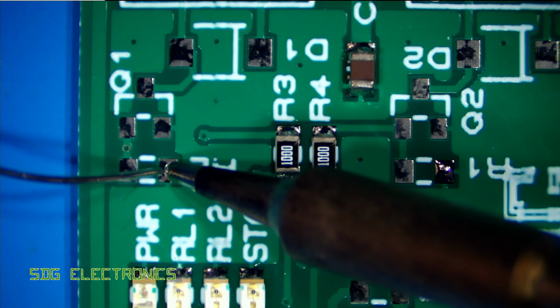Now, if you did have the money, I'd probably go for the T420D just because it's got that nice big transformer in there. There's very little chance of that failing in the future, but you should be able to replace or service the power supply in this one if it does go wrong. And it does mean that this unit's quite a bit more compact and also a lot cheaper to have shipped to your address. And I think quite a lot of the cost of the T420D is the cost of shipping and handling something of that weight. So overall, I think it's a very nice soldering iron.